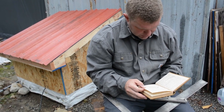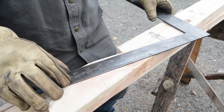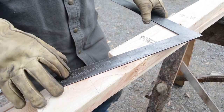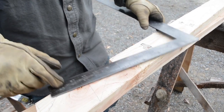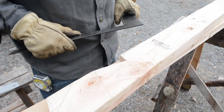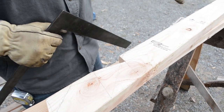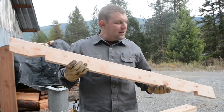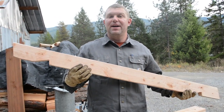We figured out the pitch of our roof, which happens to be a four-and-twelve pitch, and we use those numbers to lay out the rafter seat using the framing square. We won't do a full tutorial on that per se, but we just want to explain that the framing square is such an amazing tool for laying out things like this. We decided to seat the rafters about one inch deep on the plates, which gives us a nice tight seal. Then we used some other math to figure out the distance between the seats — that was a little confusing, but we got it sorted out. Now that we have this initial rafter, we can use it as a template, making cutting the rest of the rafters really easy.